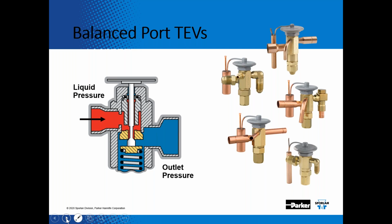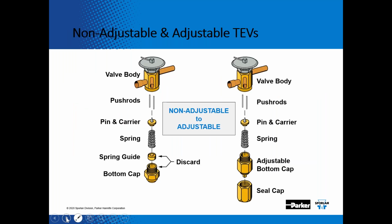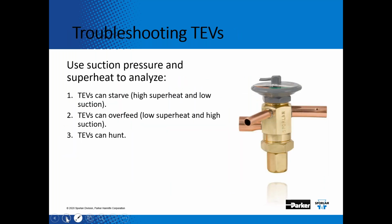The advantage of a tube and fin is there's more internal volume, so it's almost like a hydronic system with an expansion tank. So when that compressor starts up, with a tube and fin, there's almost somewhere for that 410A to burp to give this expansion valve enough time to open up, so you're not going to trip that compressor. Good question. Hopefully I answered it.